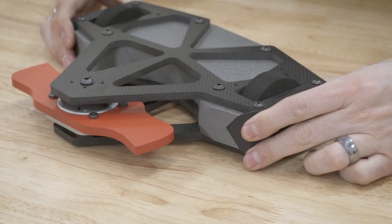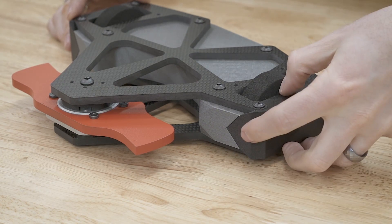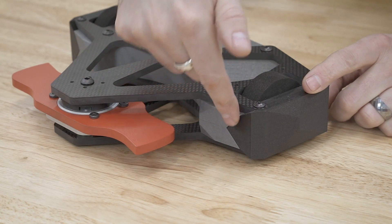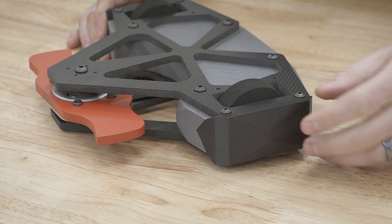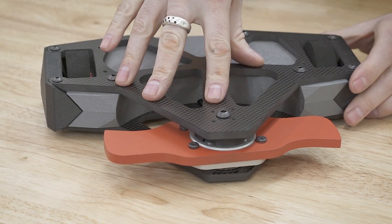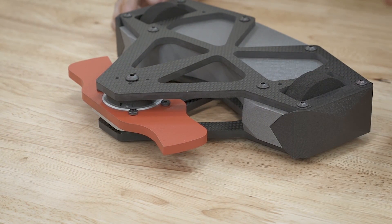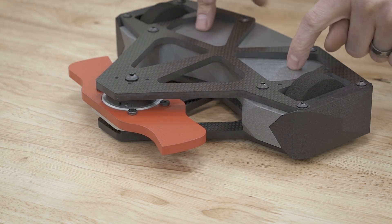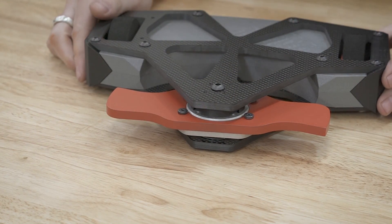Looking over at the sides, we have these wheel guards which are completely removable — there's a screw on top and bottom and these completely come off. They are mostly sacrificial. The body comes down below the frame, but the wheel guards extend up to protect the whole side of the bot. There is also a dead shaft inside that helps stabilize the wheel. In terms of materials: 6mm carbon fiber on top, hardened S7 up here, the wheel guards are nylon X — carbon fiber reinforced nylon — the gray body is nylon G, glass fiber reinforced nylon, and the hub motor up front is machined 6061 aluminum.